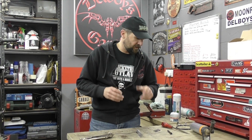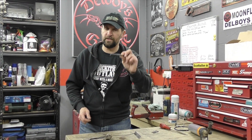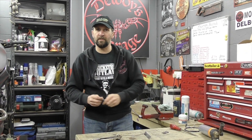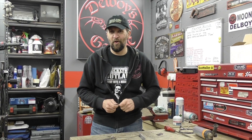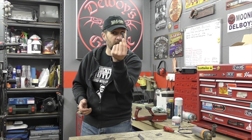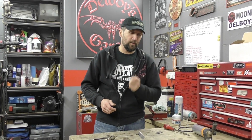In the last simple skills video I did a little how-to on oil burning a bolt so that it doesn't rust, and it absolutely fired you up — you loved it. So many of you contacted us. One guy in particular said he's got a Land Rover with loads of bolts around the roof bars and an off-road vehicle, and they all go rusty. You can take your bolts out, chuck them all in an old roasting tin, add some oil and just set fire to the lot until it all burns off — all of them at once, including the thread. There were loads of questions and I hope we managed to answer all your questions on oil burning.